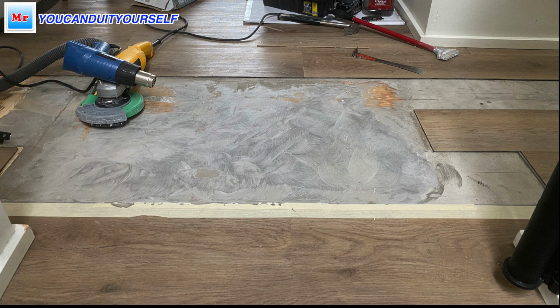First of all, I have a plan. I remove a few boards in front of the nosing, fill up that gap between the plywood, and if needed, do some leveling in front of the nosing. So I just use Planipatch. It dries very fast, and I also accelerate the drying of this Planipatch. I use a fan, a construction fan. So this whole process was very fast. It's like a couple of hours for removing, cleaning, patching, grinding, and drying this area.